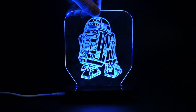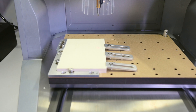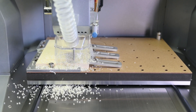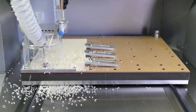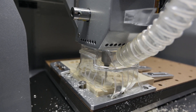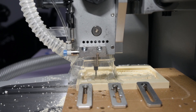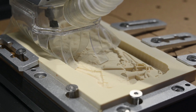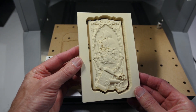Following the examples, it's been a great learning experience working with different materials and seeing what the machine is capable of. Next, we move onto an epoxy tooling board. It starts off with a laser probe that allows us to check the machining area is on the block and within the clamps. Then we switch to a single flute spiral bit and the machine starts a roughing pass, clearing away the bulk of the material — this is where the vacuum attachment really comes in handy, keeping everything tidy and the workspace clean. The V-bit is swapped in next to carve out the finer details, and the pirate ship design starts to take shape with every pass. The finished result looks great, with nice sharp details.